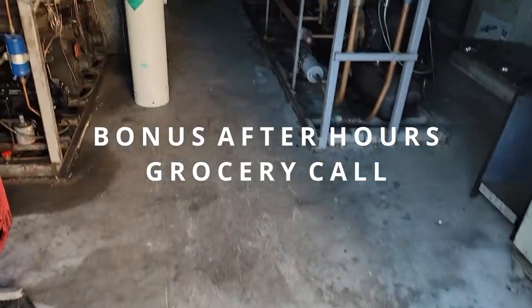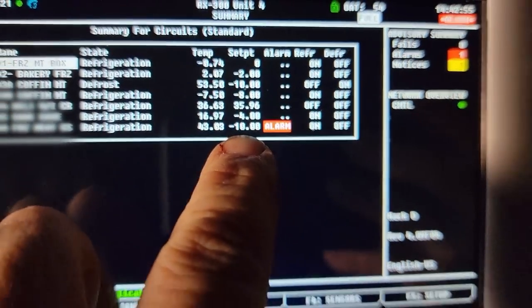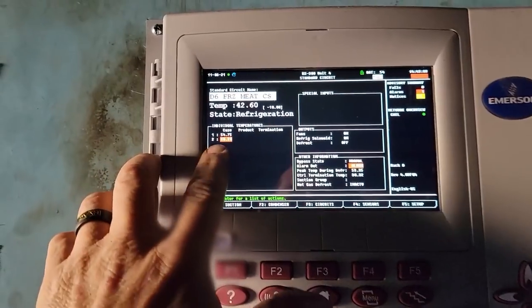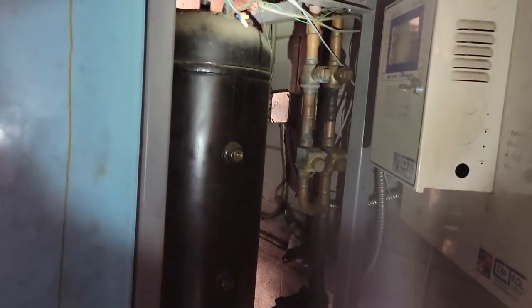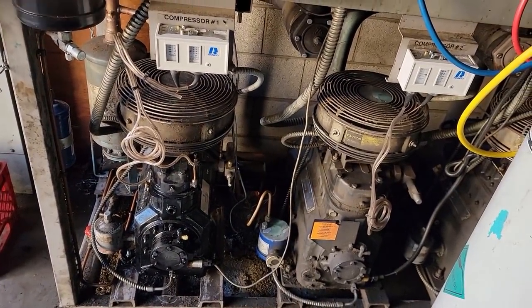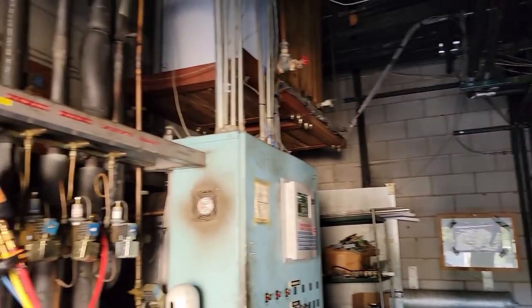So we've got an overtime call here, and this rack has an alarm, so we're adding some gas to it. My frozen meat case is supposed to be negative 10 — we're running at 43 degrees. The sight glass — I can't even find it, I think it's all digital. The receiver has little balls and they're completely all the way to the bottom. This thing's had multiple leaks in the past, so it's not a surprise. We're going to go inside and see if we can find something, and scan out here first to see if we got anything.